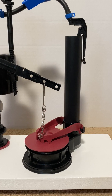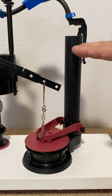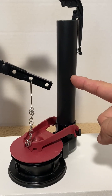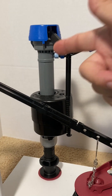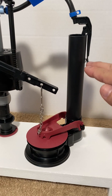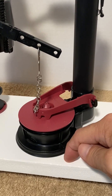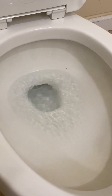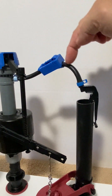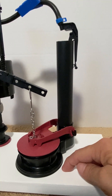Water from the fill valve slowly refills the tank until the water reaches a predetermined level that is normally one half to one inch below the top of the overflow pipe. The overflow pipe serves two purposes: first, it will prevent a flood if the fill valve fails to close — the rising water will overflow into and down the pipe, through the valve, and into the bowl. The overflow pipe's second purpose is to refill the bowl — water from the fill valve flows through the refill tube, into and down the overflow pipe, through the valve, and into the bowl.